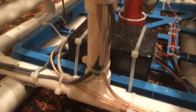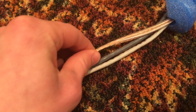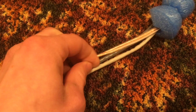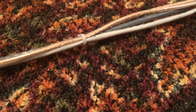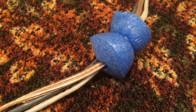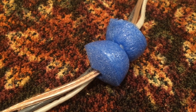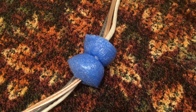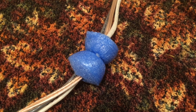Coming out of the back of the submarine is the 100-foot tether, made up of speaker wire providing power, the ethernet cable providing command and control by switching the relays, and the cable to the camera. I zip-tied all the wires together and also attached chunks of foam pool noodles to provide buoyancy. Foam pieces closer to the surface operator are larger to keep the tether out of rocks and weeds, while pieces closer to the submarine are smaller to allow the submarine to dive more easily.